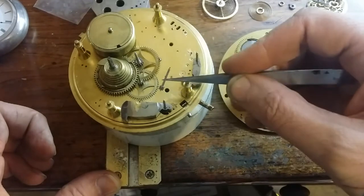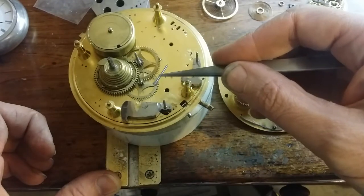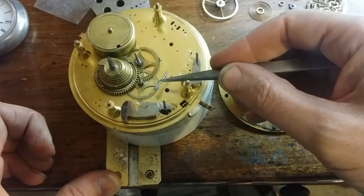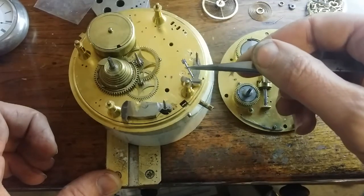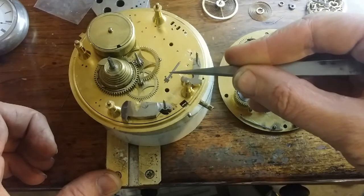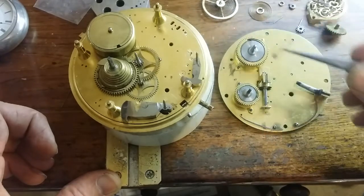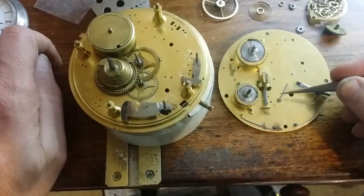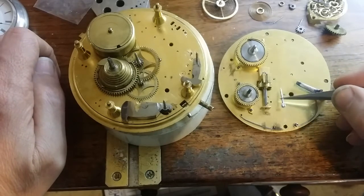At this point, I have not heat treated it. I have not done anything except take off the excess metal. I still need to heat treat it, and still need to polish the pinion. If I could give you a good close-up picture of the pinion, you would see that it's still very, very rough. So still very unfinished, but we're going to call this progressed enough that we can continue on to the wheel portion of this assembly.